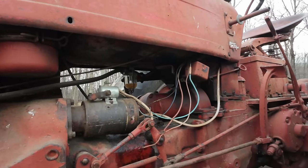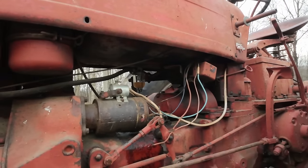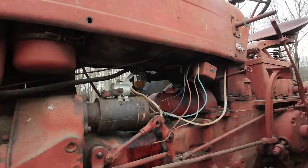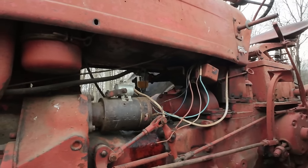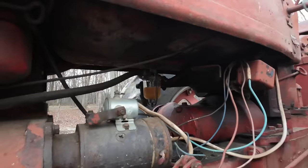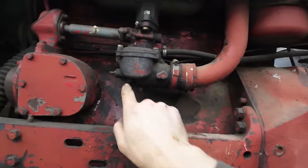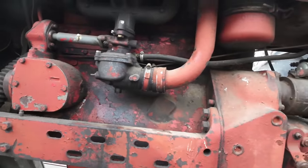Yeah. Probably pretty much going to treat this gasoline like a rinse for that fuel tank. I think that's like a 20-gallon tank, because I'd imagine they designed it so you could plow all day on one tank of gas, or at least in theory, that's what you could do. So once our sight glass fills up there, it should go down through our fuel line and then out this plug at the bottom. And we're going to wait till it comes out a little clear.